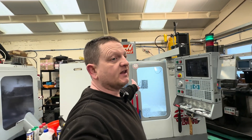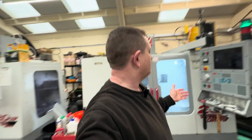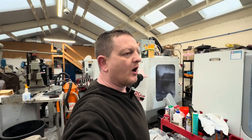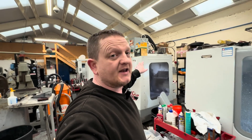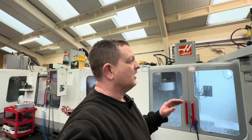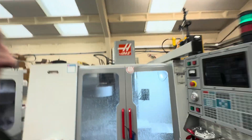In my opinion, for a 20 to 25 year old machine, that finish is completely acceptable — no worse than my other machines. But I might as well have a little play. Even when I fitted brand new ball screws from Haas — I think they were Hiwin or Bosch-Rexroth — even with brand new ones, backlash can't be set to zero, there's always something. So you have to tweak the parameters. The machine is cutting, coolant's working, everything's moving.